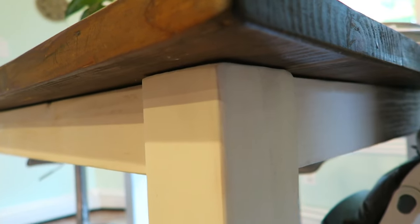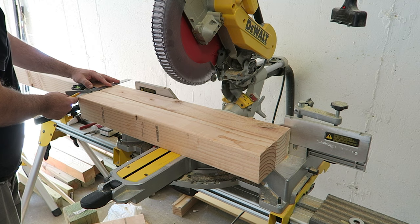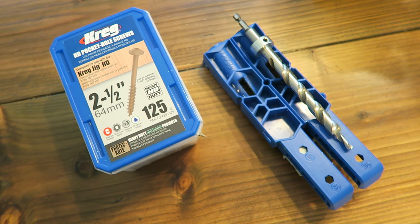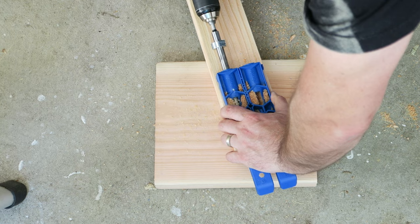Just make sure you start by figuring out the measurements of your table top itself. In this case it's going to be 60x37 inches. It's important to know those dimensions because when we make the apron we want to make sure it has a lip so you don't smack your hands into it every time you push back from the table. You're going to need a drill and a miter saw, which is really helpful for cutting all the different pieces. You're also going to need a Kreg heavy duty pocket hole jig. There are other joinery methods or you can do glue-up, but for this project I'll show you how to do it with heavy duty pocket hole screws.